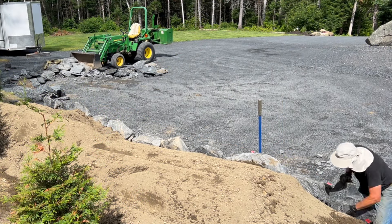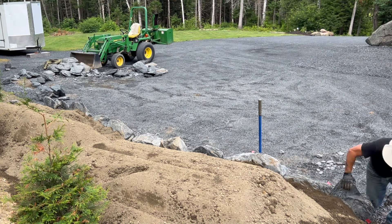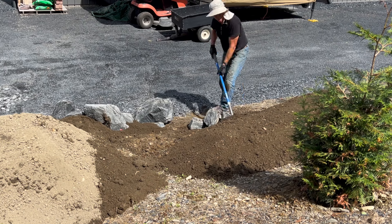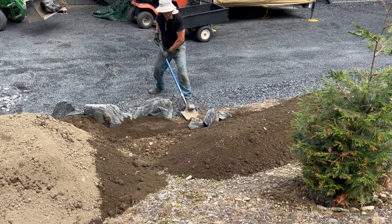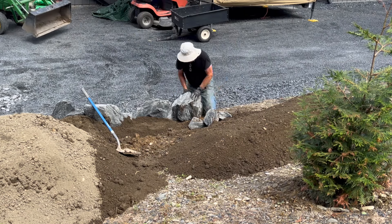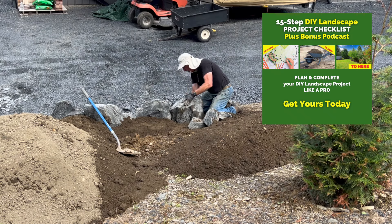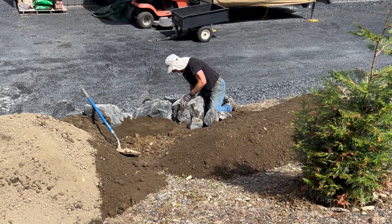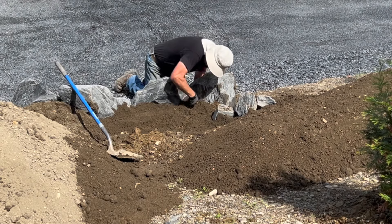For stacked block walls — large walls without good water filtration at the base — absolutely put perf pipe back there with gravel behind it, especially if you're much taller than this. This wall is only 18 to maybe 28 inches tall at most. With all those slots, I was perfectly confident there was no hydraulic pressure large enough to push these boulders over. Most of these boulders average between 180 and 400 pounds. Place them slightly tilted into the hillside, shim them with smaller broken pieces front and back, then pull dirt down to the base.